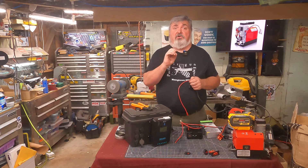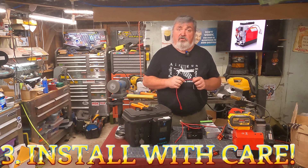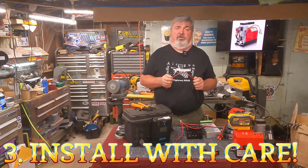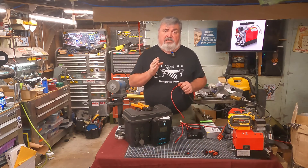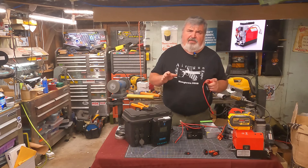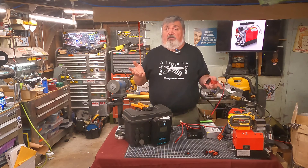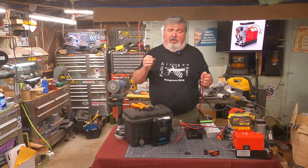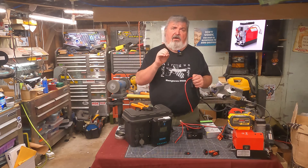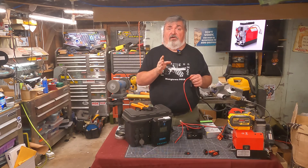Be sure to properly install quality wire with good insulation rated for the environment you're putting it in. A vehicle sees conditions that can change dramatically over time — salt, water, chemicals, vibration, shock loads, temperature extremes, you name it. Be sure the wire and how it is installed are up to the task. A bit of well-done research and care when installing might just prevent problems.